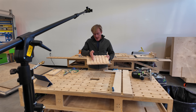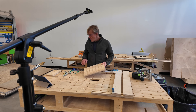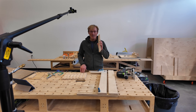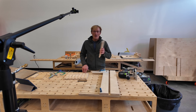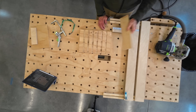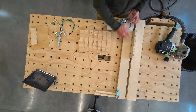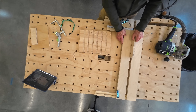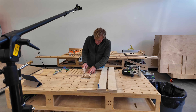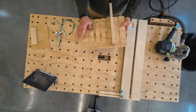I was able to do this lineup of 18 millimeter dados. I don't even really know how wide they are because it doesn't take a tape measure. I don't need to figure out if the material is three quarters, 18, or some dimension in between. All I do is use the actual material that's going to fit in the dado and put it into the jig itself, loosen the clamps, and then just snug it up. I can make it a little too tight and then it'll be really snug, so they fit really nice with no gap showing at all, like if I'm doing furniture.